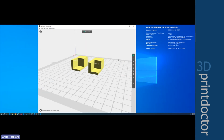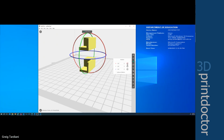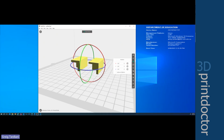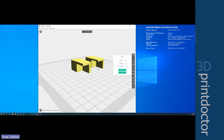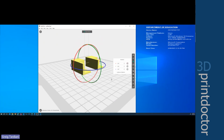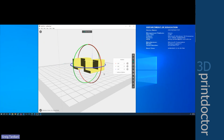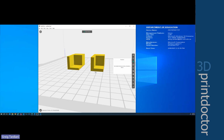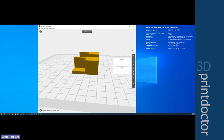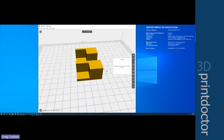But if you remember, when we had it in Tinkercad, it was orientated this way. Now, if I was trying to print it this way, I would definitely have to put supports underneath it. But when you got this into your slicing software, the FlashPrint software, the easiest thing to do would be to flip it over, put the big flat side down. And now you will get a beautiful print because you've got a nice big flat surface under here. This doesn't need any supporting. This void will support beautifully. You've got no problem. So think about how you're going to orientate your prints when they land.